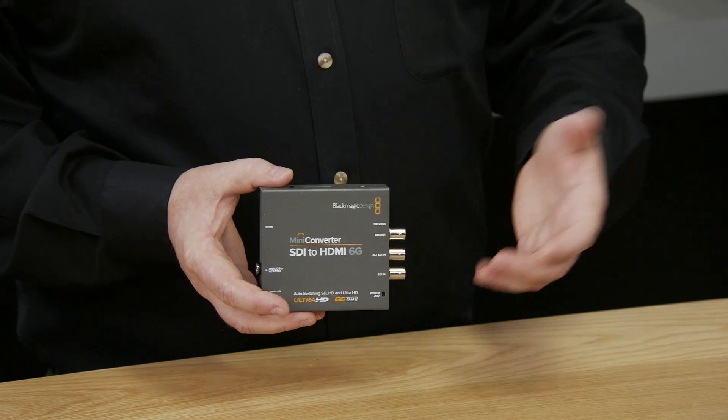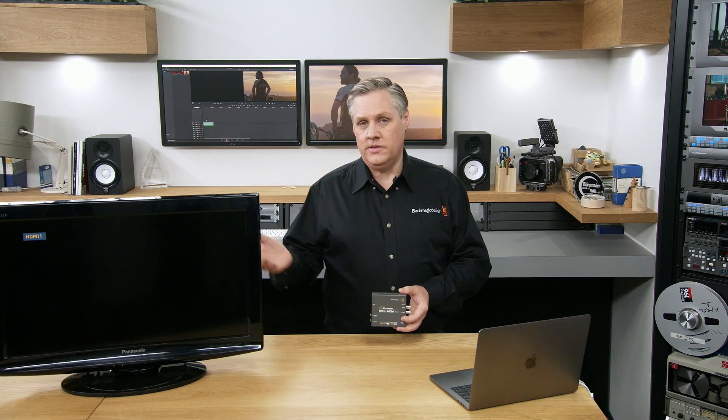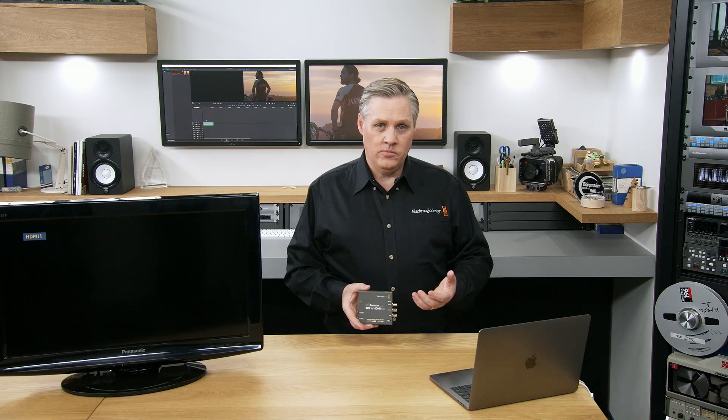There's a bit more to show you — I'm going to show you a few features of this model. This is the one that can turn a flat screen TV or a video projector into an SDI monitor. Professional SDI monitoring can be quite demanding, so this converter is packed with features that make it a lot more than a basic converter. It converts from SDI to HDMI, so it can be used for turning televisions into broadcast monitors. You can feed SDI to projectors — we feed SDI up to projectors in the roof using converters on either end so we don't have to run long HDMI cables.